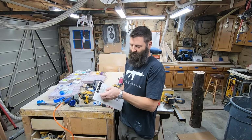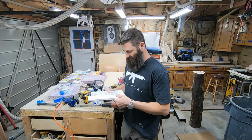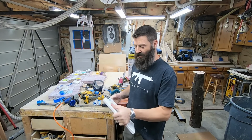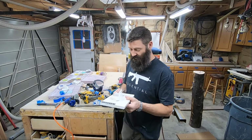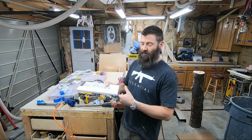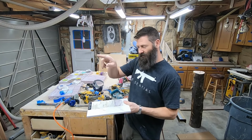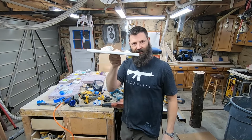But it's basically quartz, engineered stone. You know, it's got rock dust in it. Very easy to cut, and you can use it for all sorts of different things. Windowsills in kitchens is a great spot for it. You can use it on bathroom showers. So if you've made a shower pan, instead of wrapping the curb in tile, you can put one of these on the top of the curb.